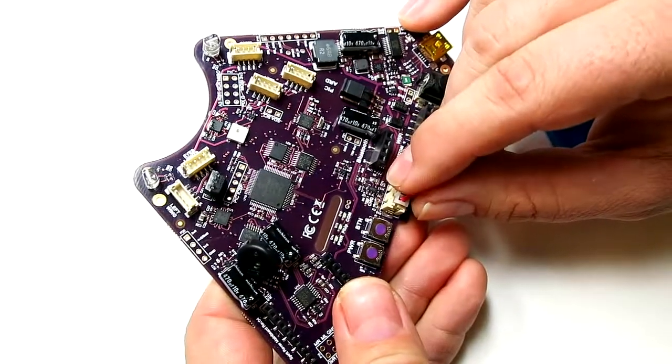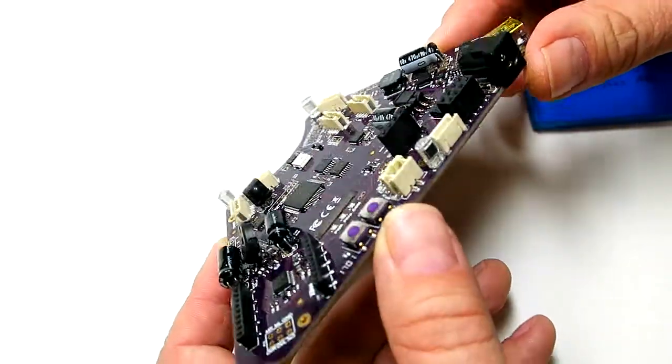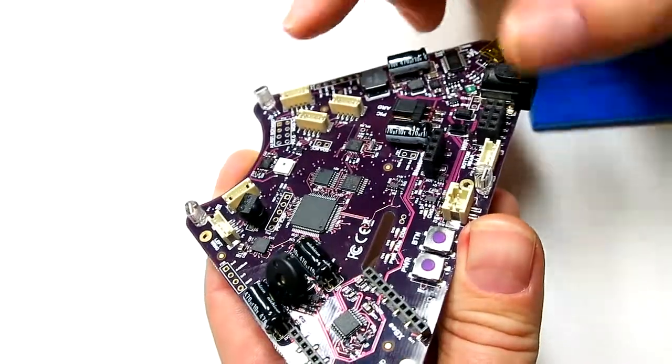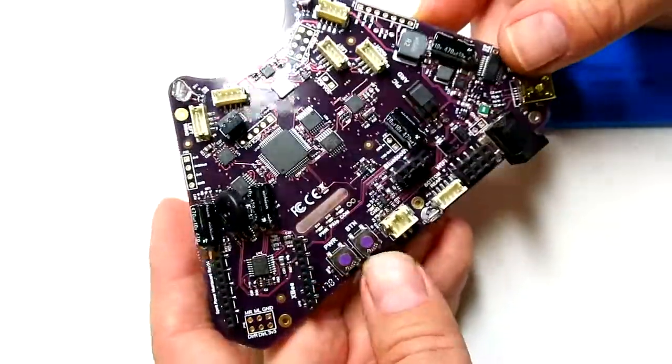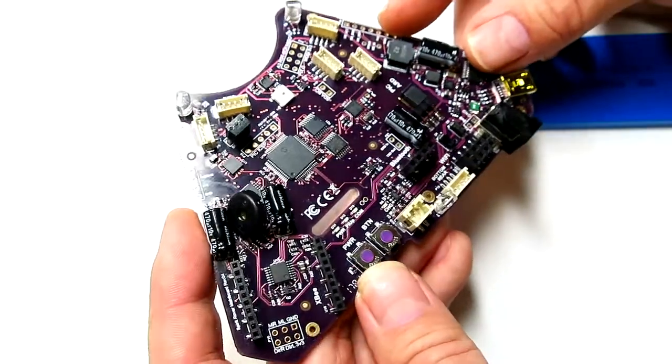When you're done with the test, go ahead and disconnect the battery. Always leave the battery disconnected anytime you're going to be working on or around the board. So if you're going to be using a tool or a screwdriver, or if you're going to be plugging anything in and out of these connectors or the connector on the bottom, go ahead and disconnect your battery first. This will make sure there's no power on the board, and just in case you bump a piece of metal, you're not going to short circuit anything.